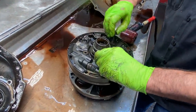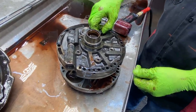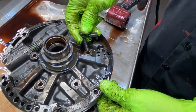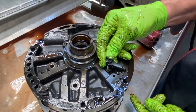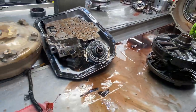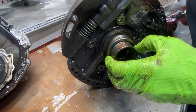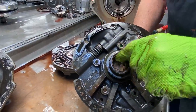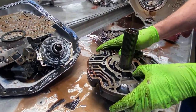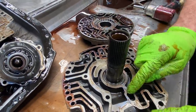We have our pump bolts here — we have a little bracket right here, some of them will have it, some of them won't. You can see it goes into this hole, and this could be for your vent — to keep fluid from going out the vent. You want to look in here for any type of wear, scotch-brite your areas up, put new bushings in here, have a thrust washer there. Come in here and look at this pump — you've got a suction side and a pressure side, so you don't want any wear anywhere in the pump.